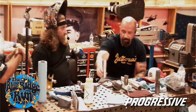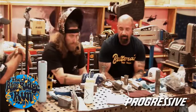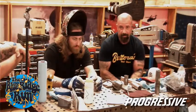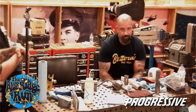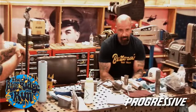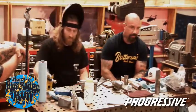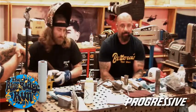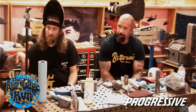But first and foremost, do everything in the world you can to avoid the situation in your fit up. That comes back to everybody saying, I'm a welder, I want to be a welder, but being a fabricator is the most important part of that, because your fit up is everything. Unless you have a fitter that fits everything for you and you just sit there and weld it. But in most anything, your prep person is as important as your finish guy.